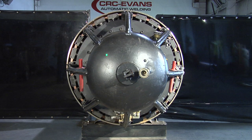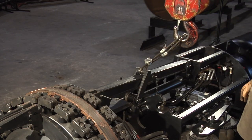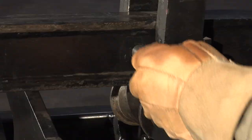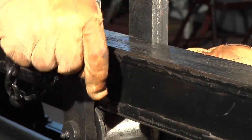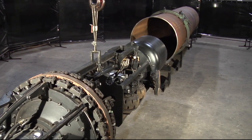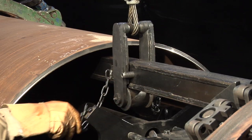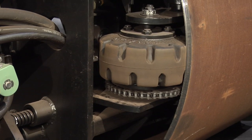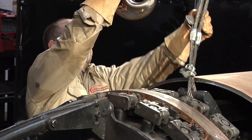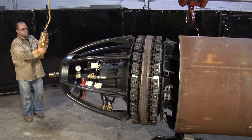A small amount of vertical movement is permissible. To install the clamp into the pipe, pick up the clamp by its lifting arm. Ensure the clevis is restrained by inserting the safety pin through the lifting beam. Lift the clamp and guide it into the pipe, rear end first, until the clevis touches the pipe end. Be sure to retract the brakes. Remove the safety pin. Raise the drive wheels and jog the clamp into the pipe until the idler roller assemblies are inside the pipe. Unhook the clevis and tuck it inside the pipe behind the clamping section.